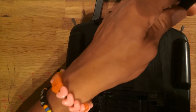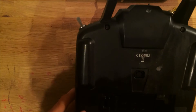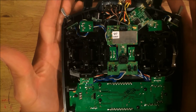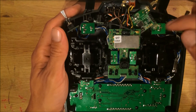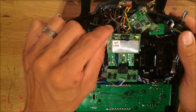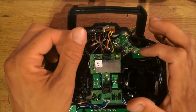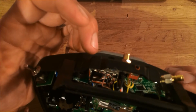With a screwdriver you just unscrew the four screws and take the back plate off the transmitter. When you've done this you can see basically everything inside the transmitter. Here's the standard module, and here is the pigtail cable which I've installed — I bought that off eBay. It comes with a connector, so you just disconnect the original antenna, connect this one instead, drill a hole, and screw that connector in place.